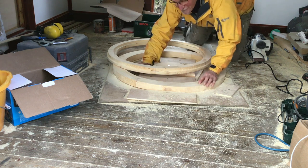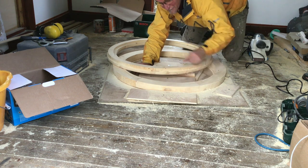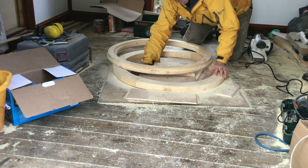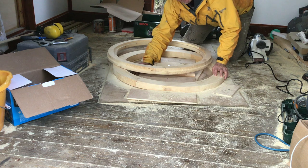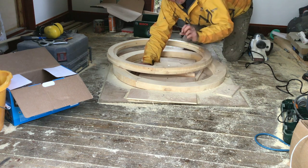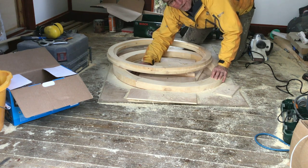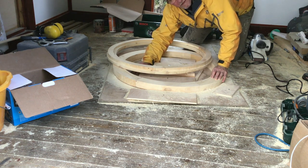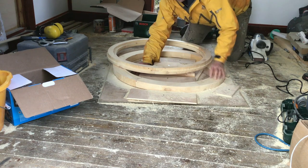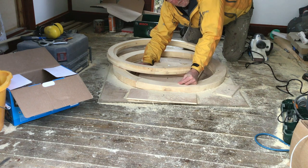So the final task is going to be creating a lip just here to fit inside here, and that will grip the window and squeeze the putty too. Now that's 15mm deep, the window is going to be 6mm, so I need 2mm at least, call it 3mm of putty either side, so that's 6 plus 6 is 12, so this lip needs to be no more than 3mm.